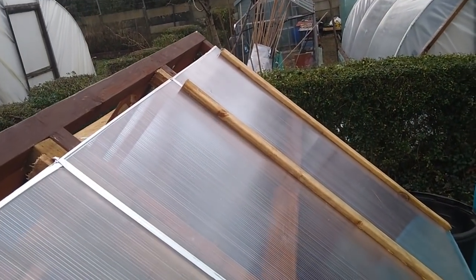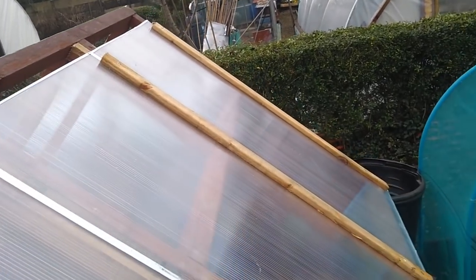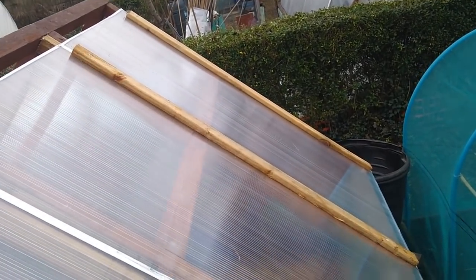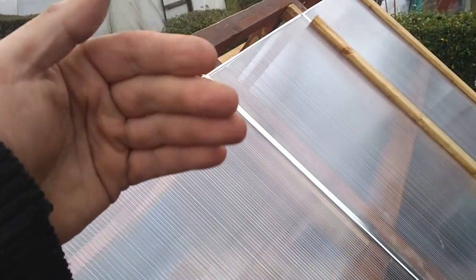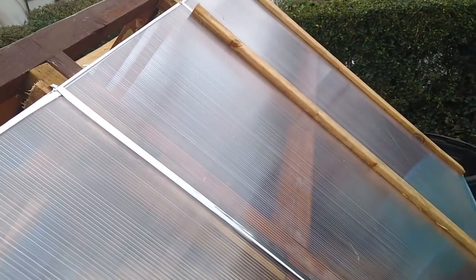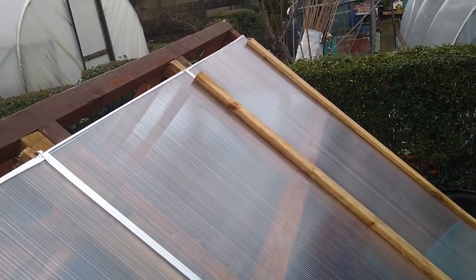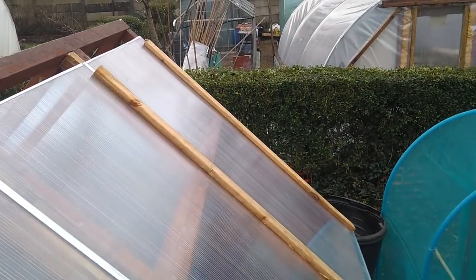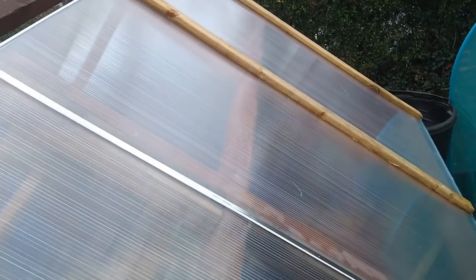Yeah, I've just started, mate. So we're just starting the first of the roof elevations. Because I know that these A-frames are not precisely square and bang on, since they were just poly-sheeted in the first place, we're having to adjust as we go along and build out from them roof supports with a few noggins so that these will sit correctly.